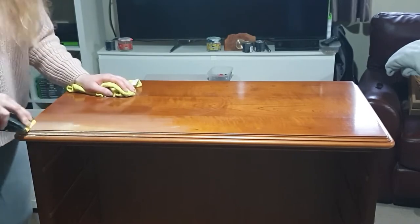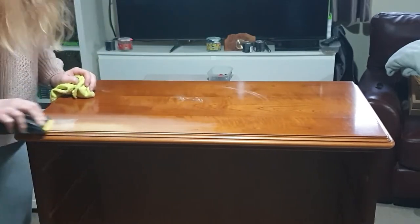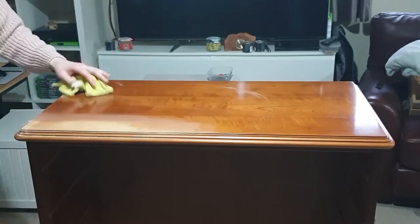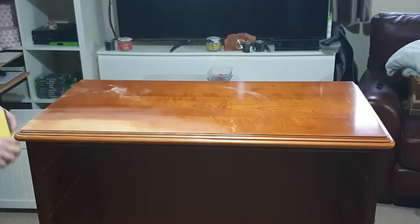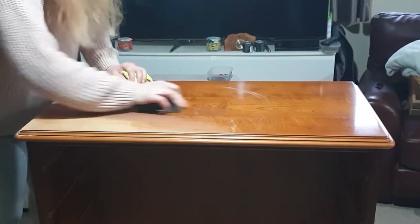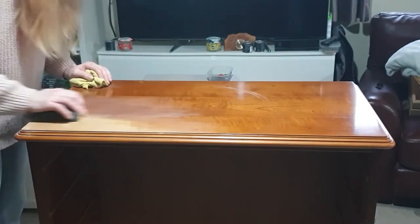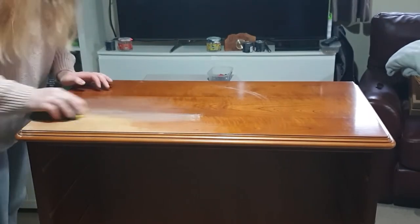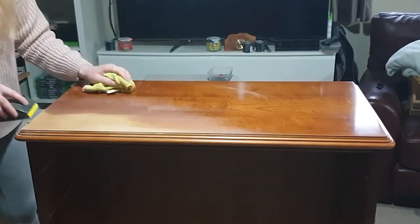After giving the piece a very deep cleaning, it was time for me to sand down the top. I was sanding by hand, and it was actually a good choice, because it turned out that it had veneer on the top — not actual wood, but veneer, which is quite a thin layer of wood that you have to be really careful with when sanding. If you sand it with an orbital sander or any sort of electric sander, you can really easily damage this thin layer and expose the pressed wood underneath it.